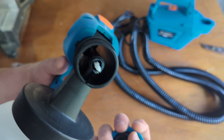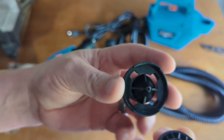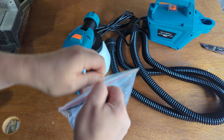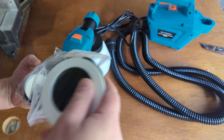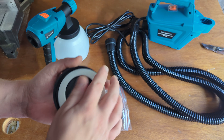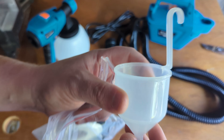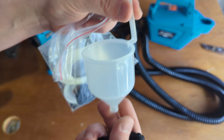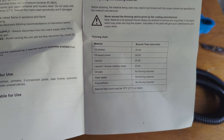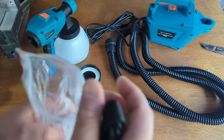Taking the top off, you can see the little nozzle for paint that gets picked up and shot through, along with the spray nozzle and the tip on the end. In the bag of accessories, we've got quite a few goodies: a new cap to seal off your paint if you're not done with your project, a couple of extra seals, replacement tips, a little cleaner, and a viscosity cup for testing paint runout. They've included a nice use guide showing how much thinning time you need in seconds based on the type of paint you're running through the gun.